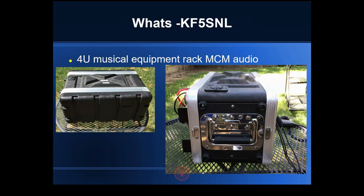What is it? It's a 4U rack — for those unfamiliar, there's a standard rack size: 19 inches wide, and a 'U' is one unit of height, which is 1.75 inches. So '4U' means you have four of those shelf levels. A 6U has six levels, and so on. The width is standardized at 19 inches.